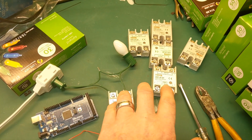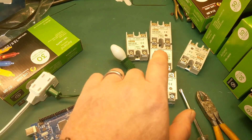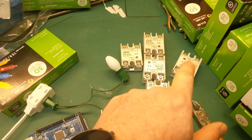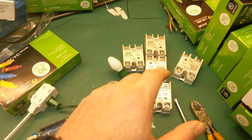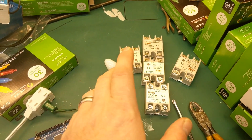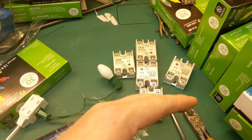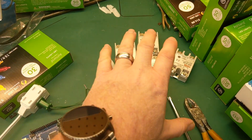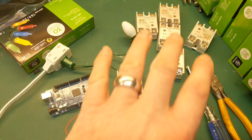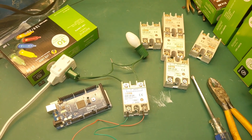We have two strings of lights on each wheel oscillating back and forth, which gives an indication of motion. The rest of the animated train is a smokestack — four different sections of smoke — and there's a bar on the wheels that goes around with it. Those four sections are tied in with the smokestack and will work consecutively. Basically we need six relays, and we're going to drive all six with this board.